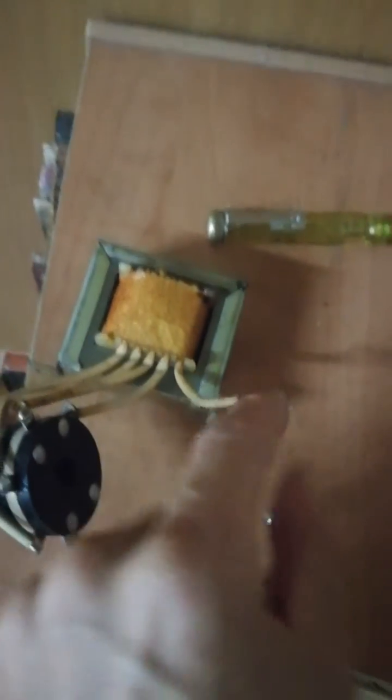That's how you wire the KDK fan controller. With all the other older controllers, the live always goes into the selector, and then the wire that comes out of the transformer is the neutral that goes to the fan. Hopefully that's helpful.